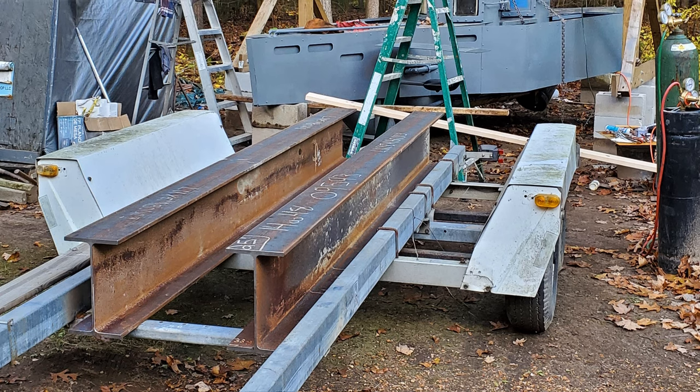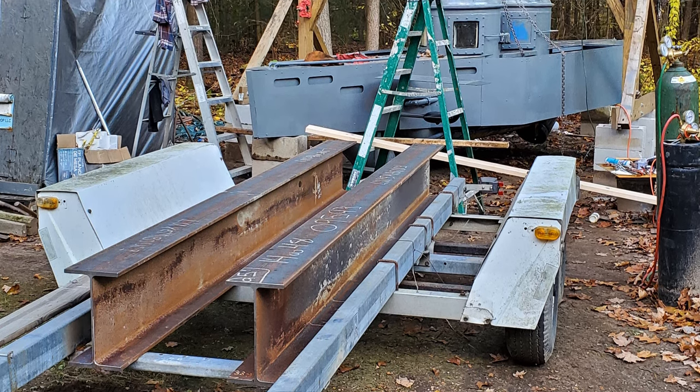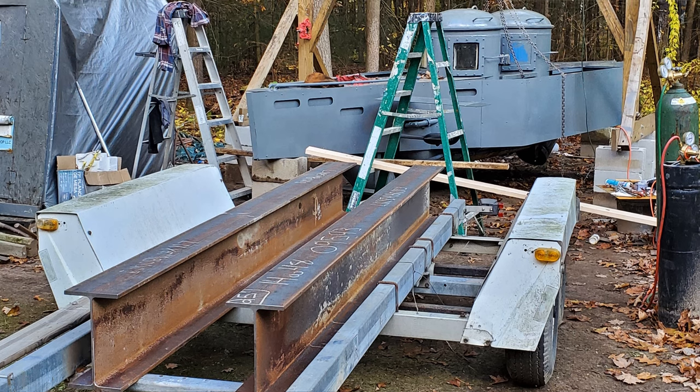After it was painted, I had to put huge steel beams on the bottom of the sub. I had to pick it up with a crane, back its trailer in — which had the two I-beams on it — and lower it down and weld those beams onto the hull. These beams keep the sub upright and make it heavy enough to submerge. We used a crane scale to figure out how heavy it was, determined the displacement, and mathed out the difference to calculate how much extra weight we'd need to add in order for it to submerge under the water.